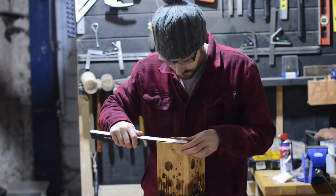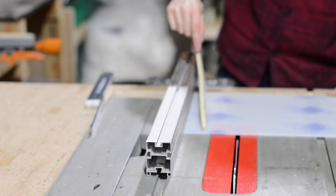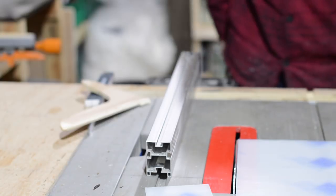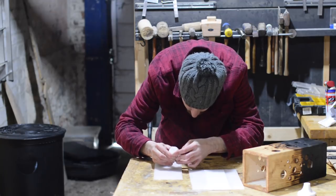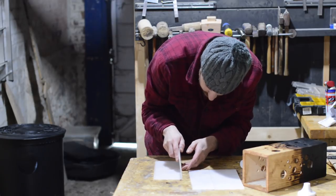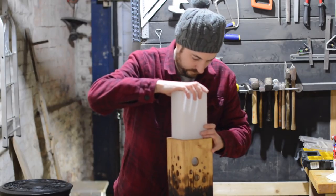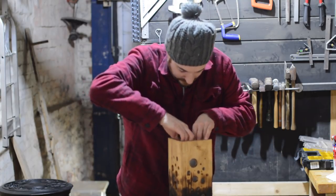As you've probably worked out, this box is going to contain a bulb, but I don't want the harsh light to come through the holes — I want it diffused a little. So I got some frosted acrylic sheet and cut this down to the size of the box. The table saw did a surprisingly good job of cutting this. When the acrylic is in the box it's not going to get knocked around much, so I just used some super glue to hold it together. This was my first time super gluing acrylic, and I was surprised how well that worked. Life was just full of surprises today. After the glue had set, it slid into the box and it was a nice tight fit — it's not going to move anywhere, and it shouldn't break.